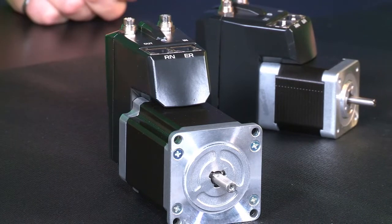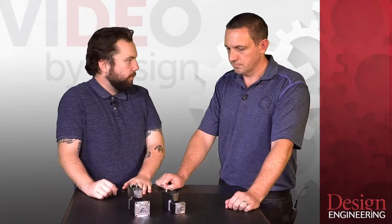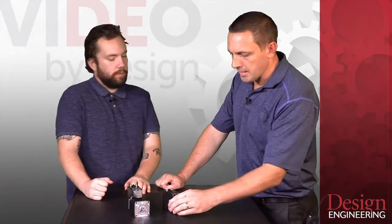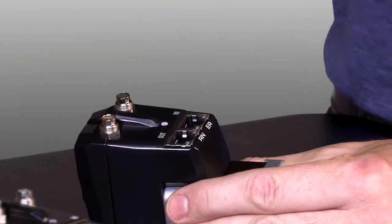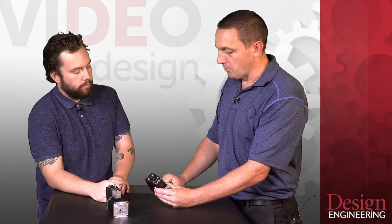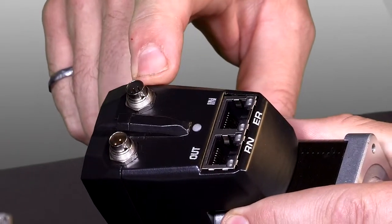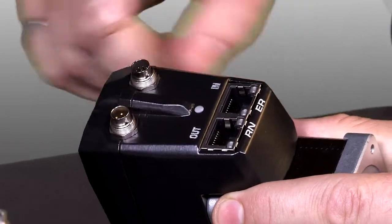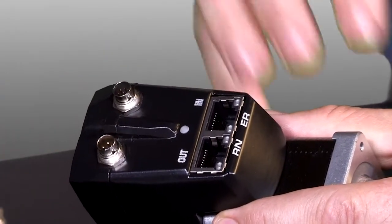All right Mark, so we're meeting for the first time. What's the back of the box bullet point list of the features of the EtherCAT integrated servo motor? So every standard EtherCAT motor is going to have an in and out port. This allows you to get your daisy chaining going along and link those 200 axes together that you want. On our particular motor we also have an IO port, some analog input, some digital inputs, and digital outputs that are all accessed through the EtherCAT as well as can be set to statuses within the motor.